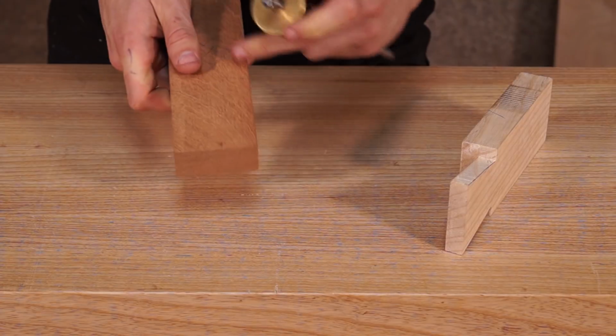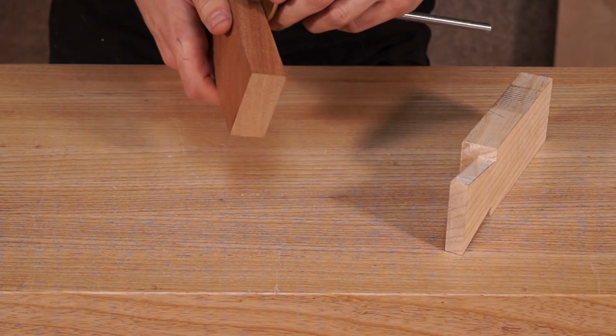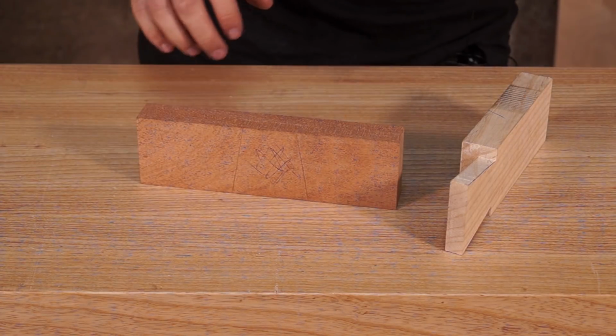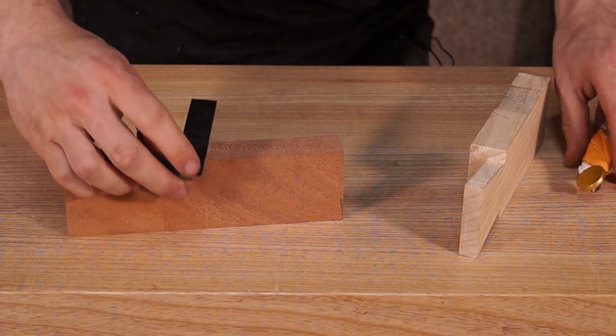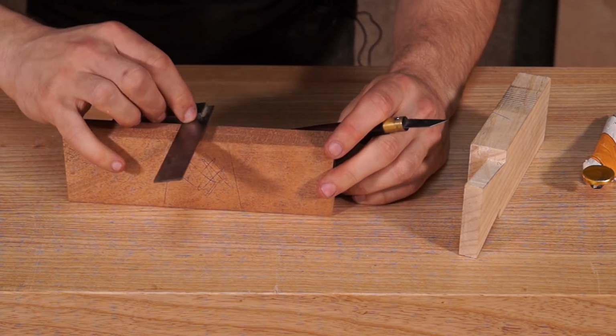And obviously now you have your dovetail marks, you can see roughly how far you need to go with this marking gauge, so you don't end up putting massive lines in the edge of your timber. There we go. So that's all done, and we're just going to square those lines down now. So again, referencing from our face side. Where's my knife? There we go. So in fact, I'll spin this round so you can actually see.